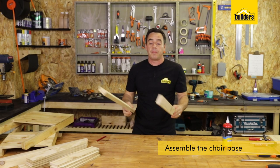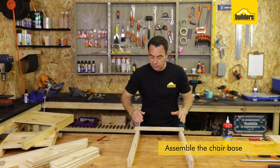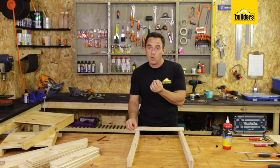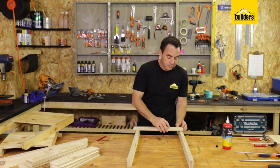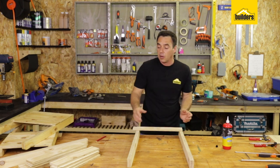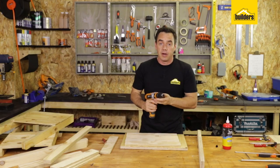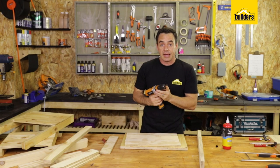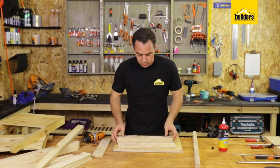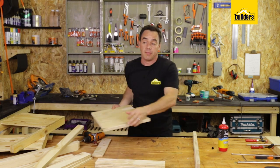Let's start with our two uprights and put those into place, then put our four slats all the way along. I'm going to pre-drill the slats first to show exactly where the drill holes are going to be — in the middle of the slat, 12 millimeters from the edge. I'll drill my pilot holes using a bit with a built-in countersink, which allows the screws to go below the surface of the timber.